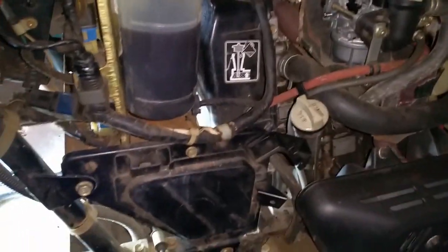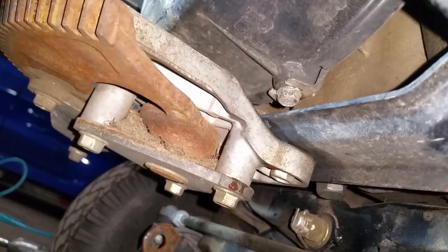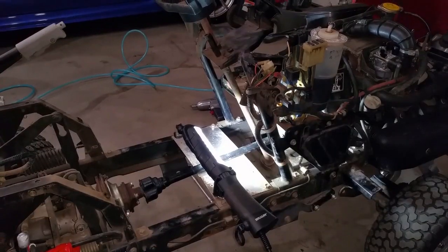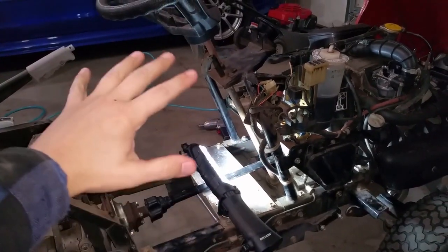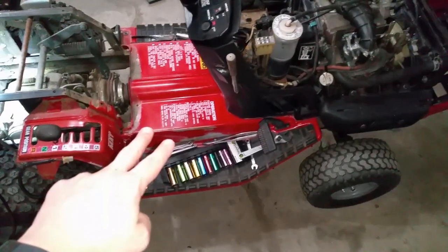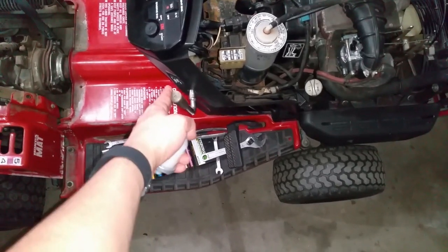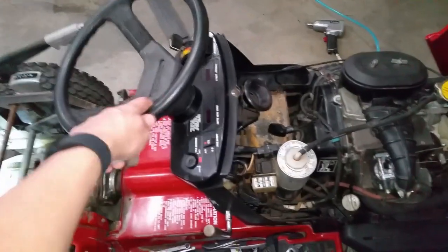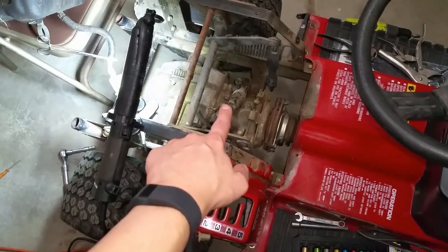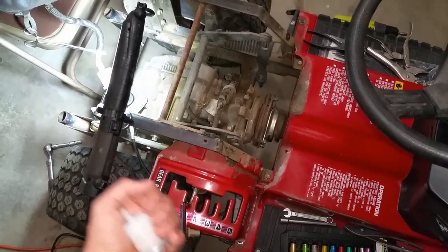One minor note on the timing belt cover: once you get all the 10mm bolts put back together, see that one right there underneath — you don't have to take that all the way out because of the steering column. You just need to loosen it in order to get it out. Now that this section is done, I'm going to put the floorboard back in and start putting the pedestal back together. It's starting to look more like a tractor. Got the floorboard back in — eight 10mm bolts hold it in. Put the clutch pedal back in and the PTO arm back in. Reconnected all the wires for the pedestal and dashboard. Now I'm working on the back of the tractor, making sure the linkage is all adjusted properly for the gear shift. This just needed to be cleaned up, and the piston needed to be cleaned as well so it allows you to shift on the fly.